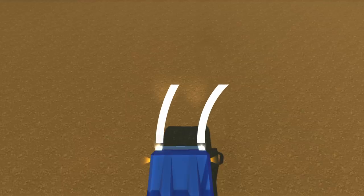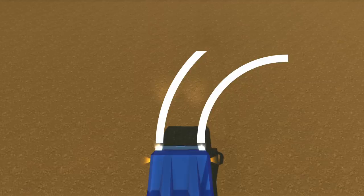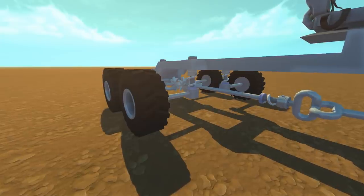Imagine you're in a truck and you want to make a right turn. As you complete the right turn, your inside wheel gets to the end of the turn before your outside wheel, because the outside wheel has to travel a greater distance than the inside one. And that is why vehicles have a differential — so that as you're making a turn, your wheels can change speeds and get to the destination at the same time.